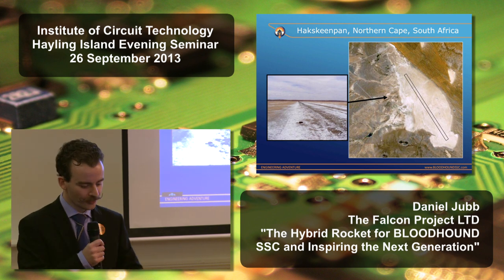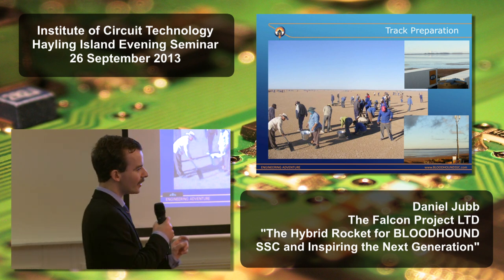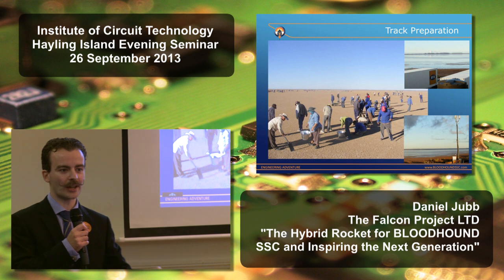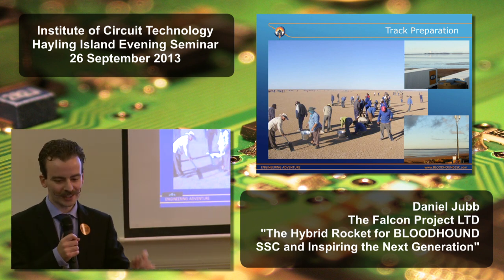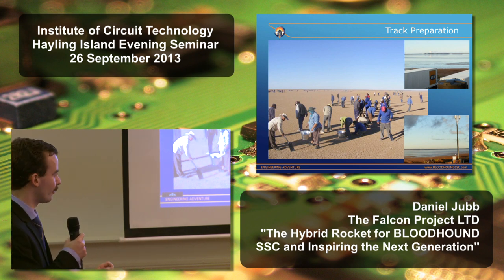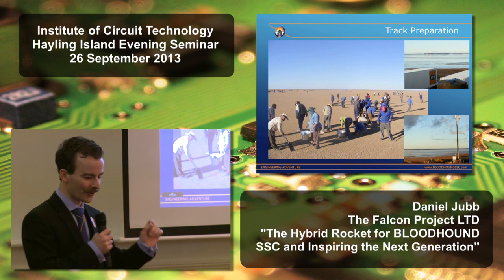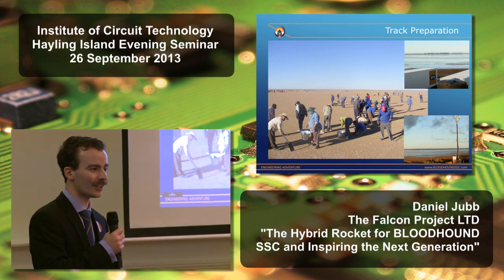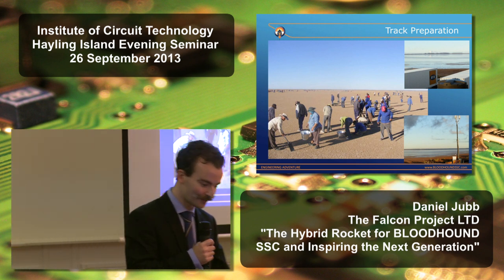There's another problem, though. The entire surface of the desert was covered with tiny stones, and even something about 10 millimeters in diameter, if a wheel hits that at 1,000 miles an hour, could potentially cause that wheel to disintegrate. So we've had to clear the entire desert surface, 24 million square meters cleared by hand. We've had a team of about 300 people out there for a couple of years, and they have finally finished it. But it's the equivalent of clearing a four-lane road from here to Moscow by hand.